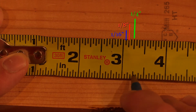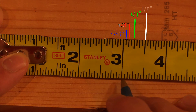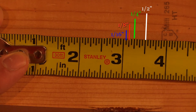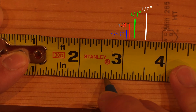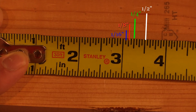So you see how this is working — basically these dashes are all eighths. When someone says a quarter inch, that's this mark right here — one fourth of an inch. This is one half. So this little grid works its way up: a sixteenth, an eighth, a quarter, then a half. Most tape measures are incremental with the lines — smallest line, bigger, bigger, bigger, and then the full line is obviously the biggest. So if I were to say 'measure me a board to two and five eighths,' you go to two, go over to the half mark — four eighths is one half — then jump up one more eighth. Now I'm at two and five eighths.